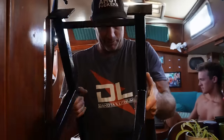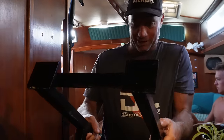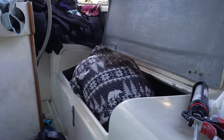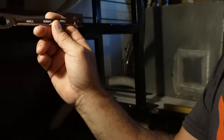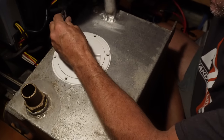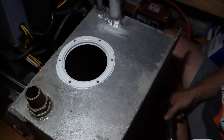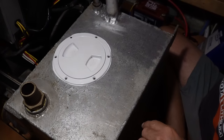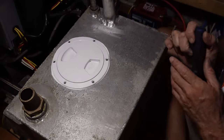Giving it a quick little paint job. Time to install this. I've got Bella up in the dive locker — she's putting a little dab of sealant on the top of the screws just in case we get water in the locker. Using these little ratchet spinners — they're good for getting into tight spots. There's our inspection outlet if you want to have a look at some poo now and then. Hopefully I don't have to open it, but it's there if something blocks up. It's gravity-fed — set up so it'll just drain. No pumps. Pretty simple.